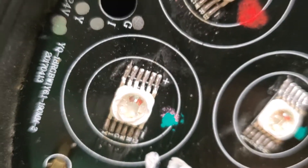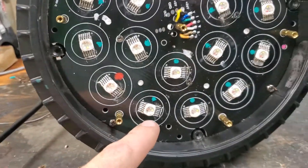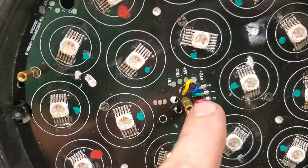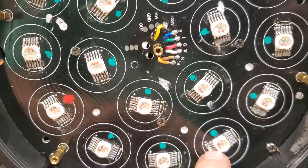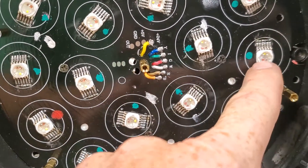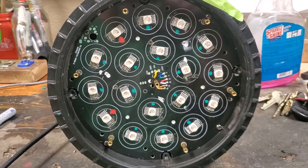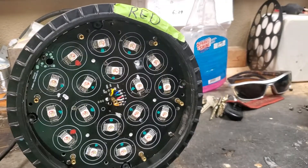That's because one of them has a break. The main circuit is over here — it looks like positive is shared all the way through, and down the middle your trigger is negative. It loops over to the negative side, jumps over to the next one, and if one's burnt out it can't go to the next one and basically all of them don't work. We've already marked them with red felt pen where we didn't see the color working. Red is the only one that doesn't work on this one.